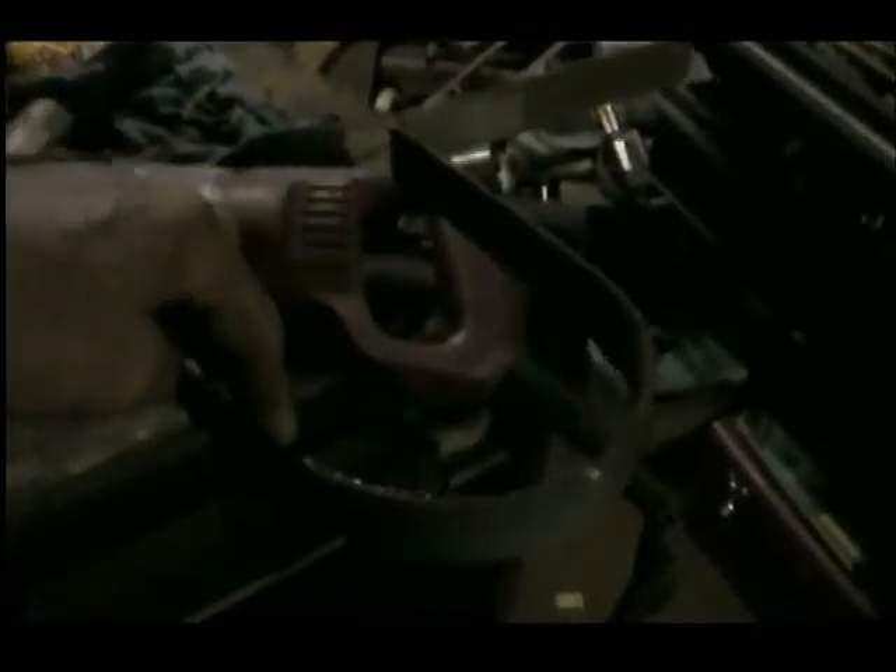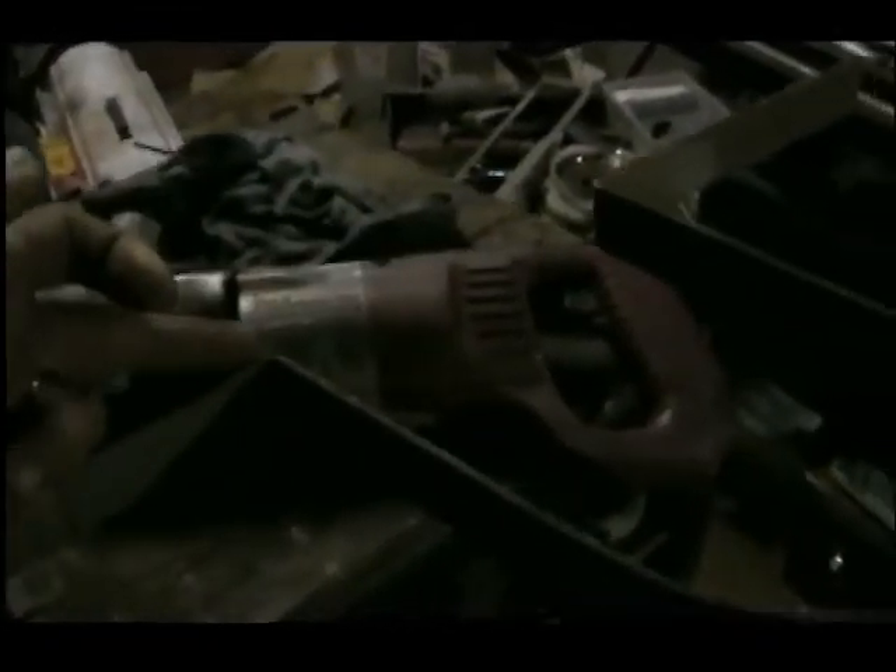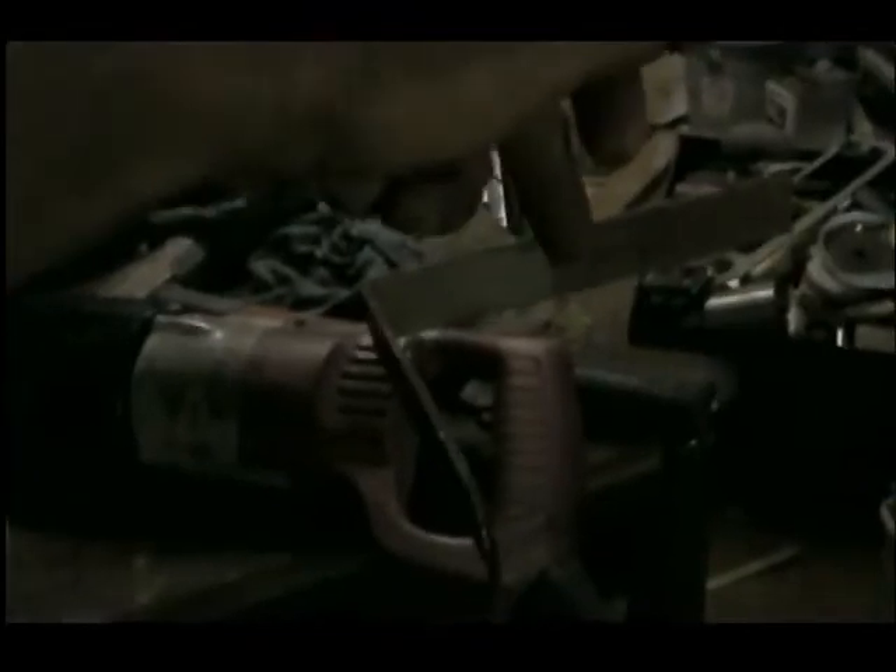I bent it — I found something five inches around. I didn't use a piece of wood but I found on my floor jack that section there is five inches across, so I bent it around that. That's what gave me this shape. Then from here to here on both sides, I went eight and a quarter, and then I measured over three and I'm going to cut it off at three.